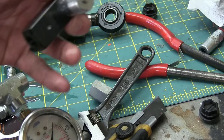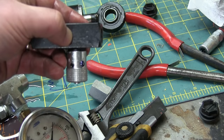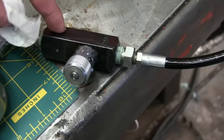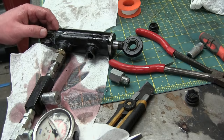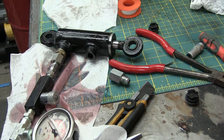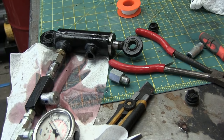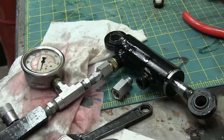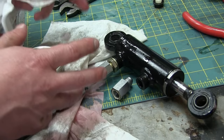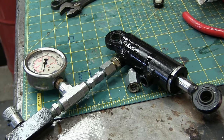This is actually a flow control valve - the oil free-flows into the cylinder but it's stopped by this valve and check ball. When we want to release the pressure, we can just open this little needle valve. If you don't have one of these, you can make your own check valve very easily and I'll show you how to do that in the next video. So we've got Mark II installed. Close this down and then pump it up. The gauge is on the wrong side - okay, that's way better - it actually friggin works! Now we can put the gauge on the proper side. We have very successfully made an oily mess, but I think we've got it licked now. The whole trick is you've got to be smarter than the cylinder.